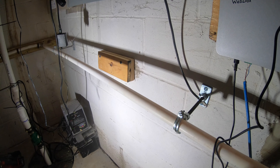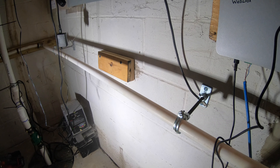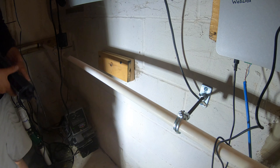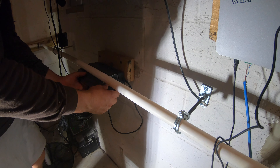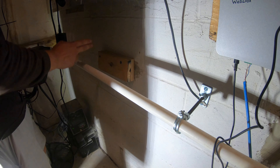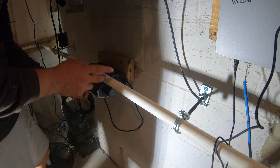As you can see, we now have the wood mounted on the wall. I had to use Tapcon concrete screws and a 3/16 inch masonry drill bit to drill into the cinder block — you won't be able to drill into it with just a regular bit. The center of the board is about even with the pipe so the Fin can sit against the wall with the pipe directly in line with the fittings. Now we're going to have to cut a section of this pipe out.